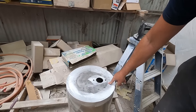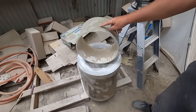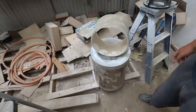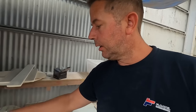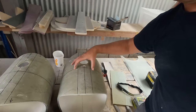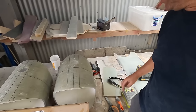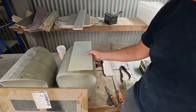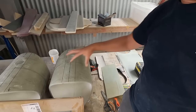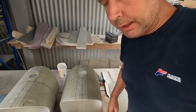This flat surface. Perfect. Now so I can see it. I need a round surface like this to fit on a flat surface like that. Perfect. And I'm gonna do that with various sheets of fiberglass. So, on here, I will laminate a few layers. And then I will eventually add a solid fiberglass sheet to that. So I'll make a fairing block or something between the two surfaces. That's the plan.